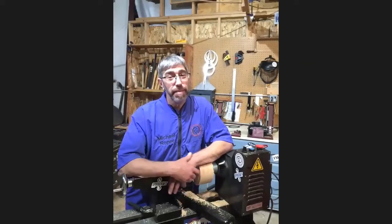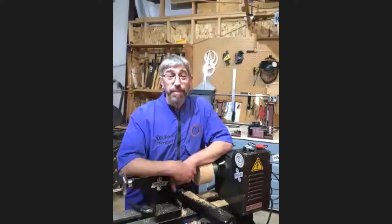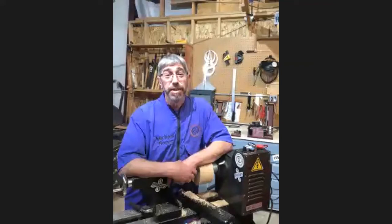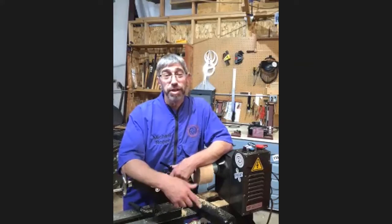I've built furniture for a long time, and when 3 out of 4 parts aren't the right size, you're in trouble. But when I do a big production run, I can't be winging those shapes. I have to nail that shape. The last run was 55 beer tap handles, all done by hand, and you can't just eyeball that. You have to have a story stick and be able to do a layout. Yeah.